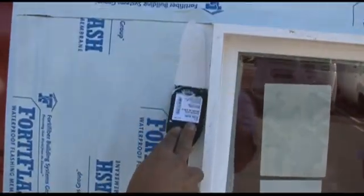Notice that Percy has radiused the corners of his putty knife so that when he butters his sealant, he gets a nice edge right up against the window. This is particularly important if you have a nail fin that inserts into the window and is not integral. Now Percy is buttering his sealant nice and flat — it should look just like this, spread nicely to about an inch away from the nail fin.